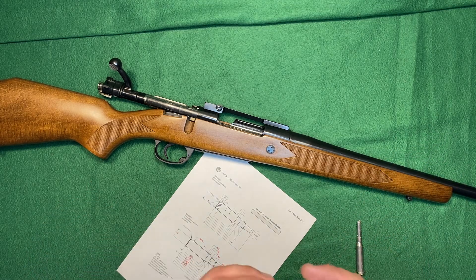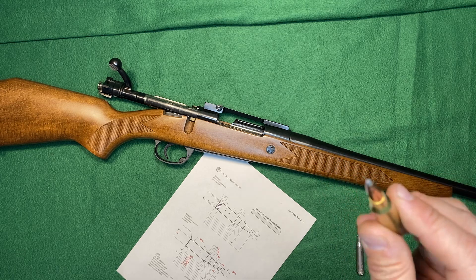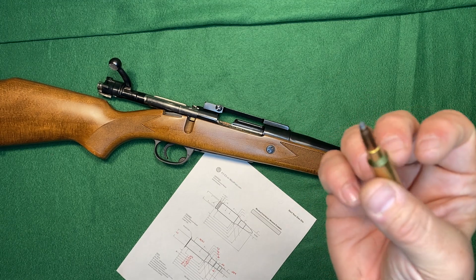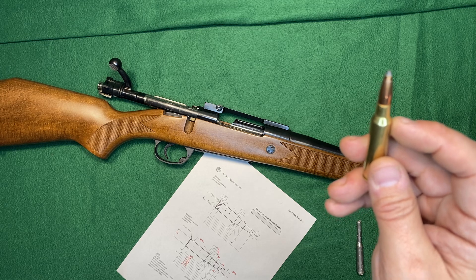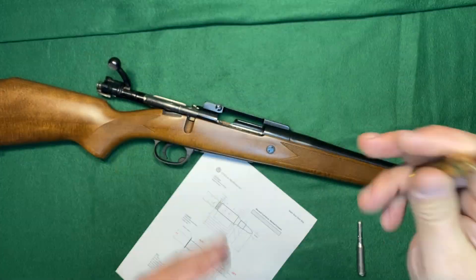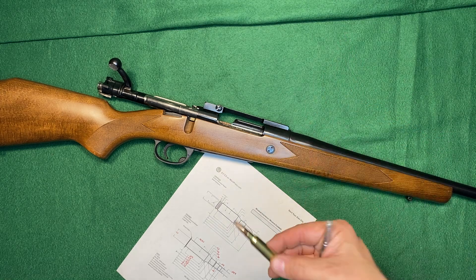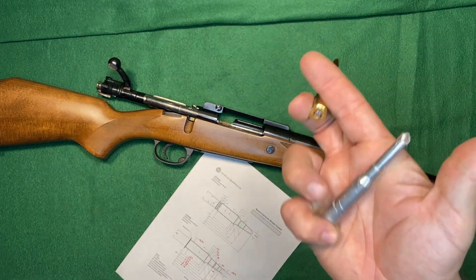I've done a little looking into this, because it's been my fun recently trying to figure this thing out. There are two well-known 6.5 by 55s: one is the typical Swedish Mauser — 6.5 Swedish Mauser — and the other is an Ackley Improved or improved type. The standard shoulder sits at a 30-degree angle; the Improved has a much flatter shoulder. According to my measurements, this one is sitting at roughly a 20-degree angle. So you have 20, 30, and then the Improved is a 40. Somebody decided they were going to change it from a 30-degree angle to a 20-degree angle, by the looks of it.